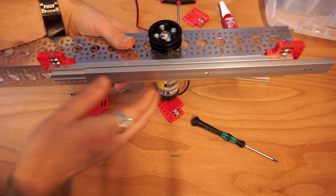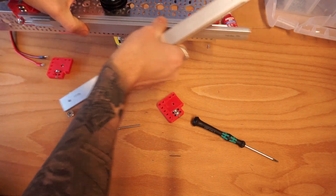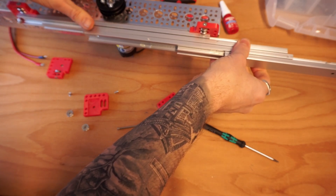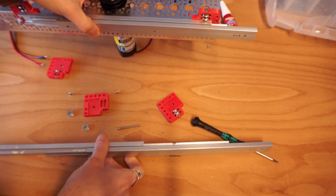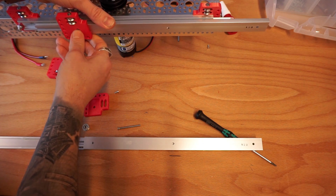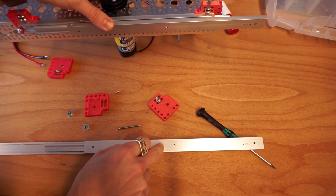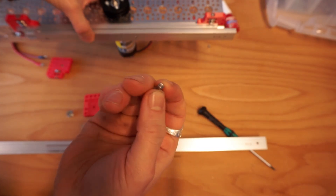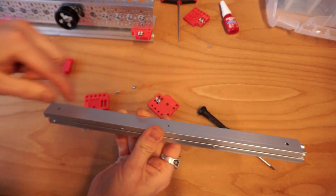My stage is going to be running up this way and I'm going to be making a multi-stage system today. I like to lay out my system to make sure that when I lay them out next to each other they're both going to actually extend out. Because I'm going to have to put another stage in between here, I'm going to have to use a sleeve nut. The problem with these sleeve nuts is that the sleeve nut is not going to fit through the hole on our standard Misumi slide because they only have a 3mm hole, but this sleeve nut has an internal diameter of 4.5mm. So we're actually going to drill out the two ends of my slide here to make sure they go in.